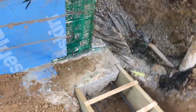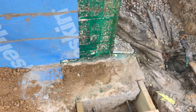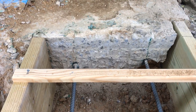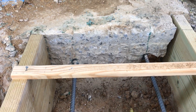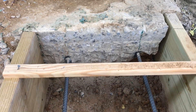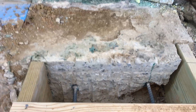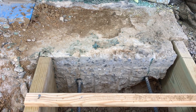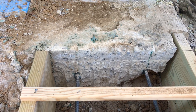What we did was we drilled horizontal holes into the side of the old footing after we squared it up a little bit. This old footing is unusually wide, so we went about a foot into it.